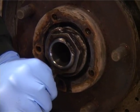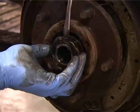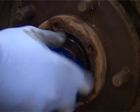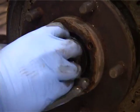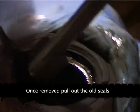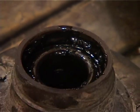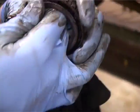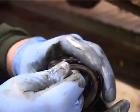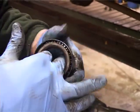Lock tabs back again, in the hub. Once you get all the old grease and oil off, it actually looks quite a good bearing — feels nice. There's no gritting, there's no nastiness; the oil is nice and shiny.